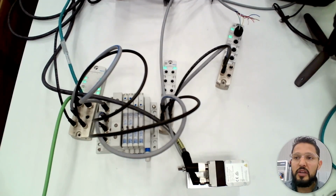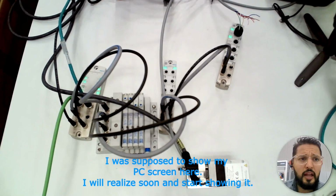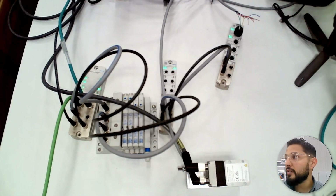One of them is that you can download a software called Festo Field Device Tool, like so. You can download this from the Festo website. Basically, what this does is scan anything on the Ethernet network from your computer, and then from here you can assign an IP address. Right now I already have an IP address assigned to my module, but as you can see, it already scanned the network and it's being shown here. My module is at 1.5. Oh, if only I shared my screen, right?